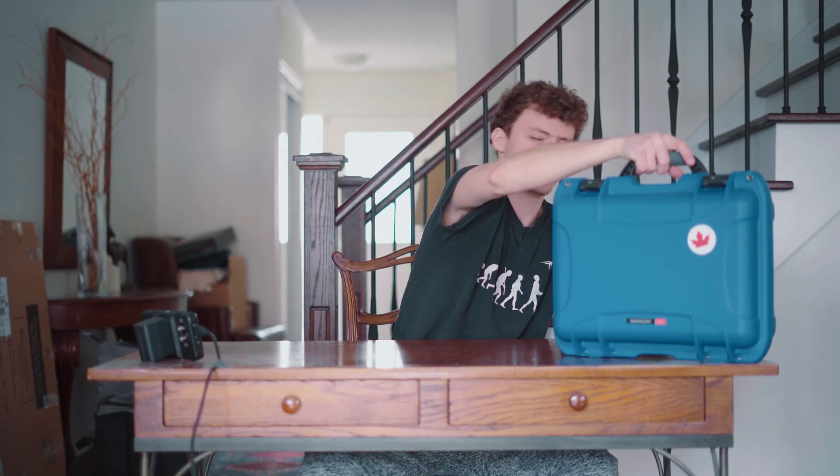Let's go ahead and make your drone one step safer. The first thing we need to address is making sure you know the difference between your drone's compass and the IMU. While you should be calibrating your drone's compass before each and every flight, that is not the case for your IMU. Compass calibration aligns the drone's flight system with the Earth's magnetic north, whereas the IMU is a sensor that detects motion along a horizontal plane, as well as increases and decreases in altitude. So the compass should be calibrated before each and every flight — but when should you calibrate your IMU?